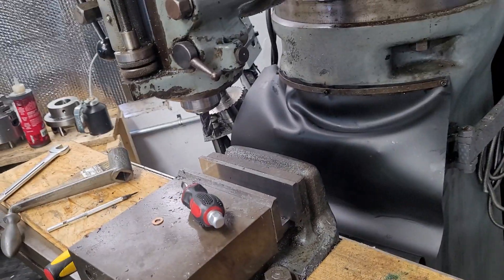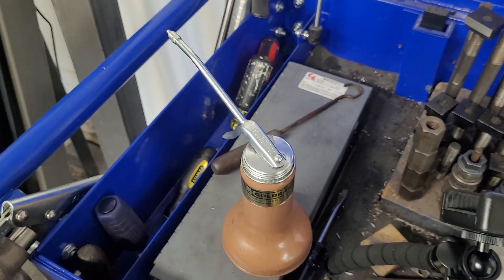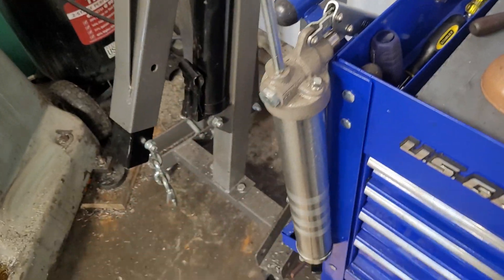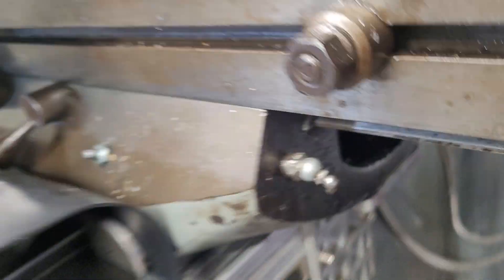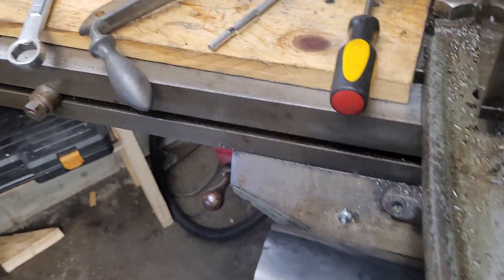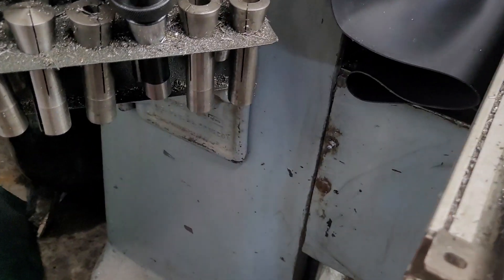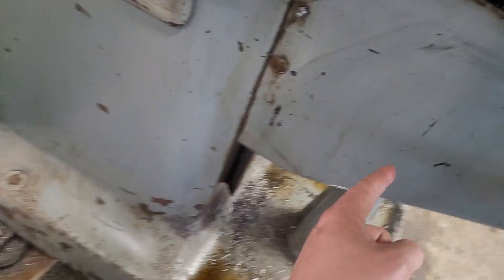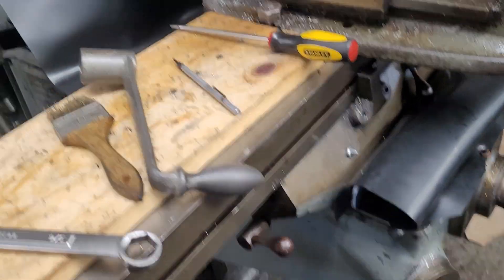When I leave it, the machine leaves a puddle of oil on the table. I just use one of these golden rods - they're pretty cheap - and this is an oil gun, not a grease gun, because you have these oil fittings. There are two here on the saddle, one on each side of the table, and two on the front of the saddle. There's also an oil fitting over here. You can see where this machine is drilled for - there are a couple of holes - I think this had an auto oiler at one point, or one of those one-shot pump setups that got pulled off.